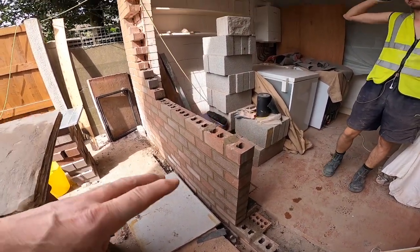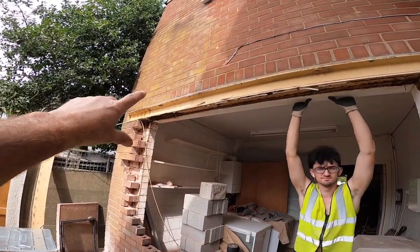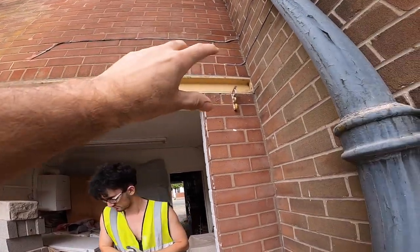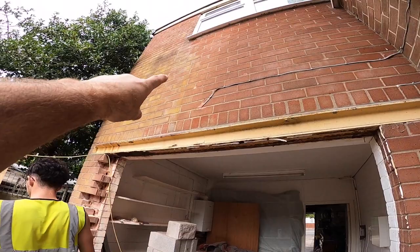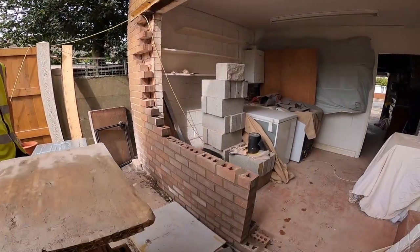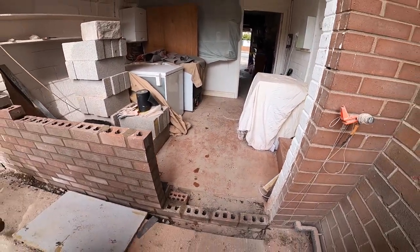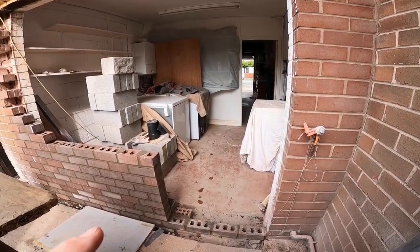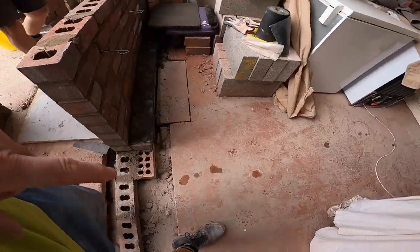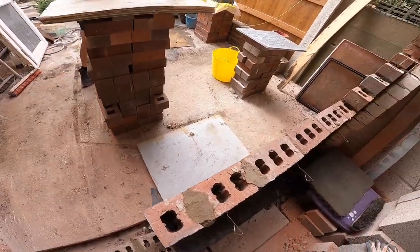So tomorrow we've got the brickwork to finish, this section. Those steels have got to come out, and the brick edge has got to come out. All getting bricked up, new lintels going over the door, all the cracked bricks coming out up there. I think there's about 8, and they're repointed. Brickwork, blockwork. We've got to fit the door, which we've not done before, but we'll tackle it, and patch the floor where we've cut out. So, bed the flag in, patch the floor, bed the new manhole cover on.